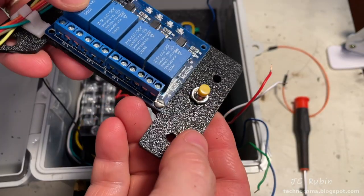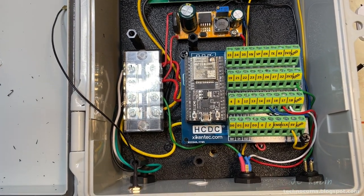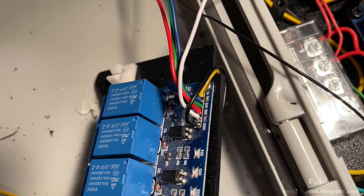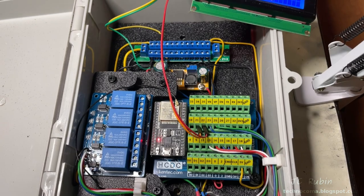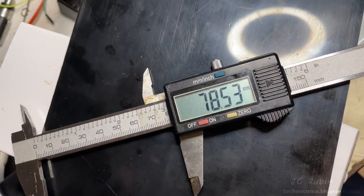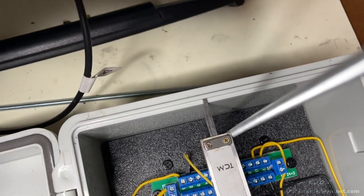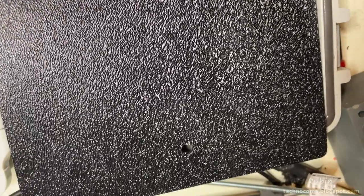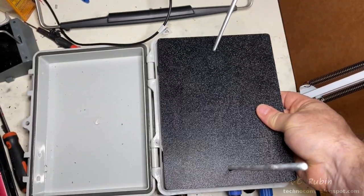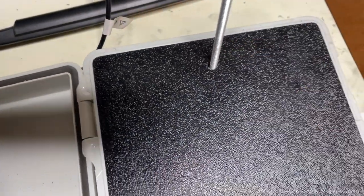While the glue was drying I redid all the cabling, making it nice and orderly on all levels — removing headers and directly soldering cables onto the relay board, as well as leads onto the reset switch. Reconnected everything for a quick test and everything worked on diagnostic. For the outer cover, I measured the width to make a center line, then took the distance from the box lip to the middle of the rod on the center line. That's where I drilled the hole, and the same distance was drilled on both sides — the cover fits perfectly, with the rods fitting through without binding.